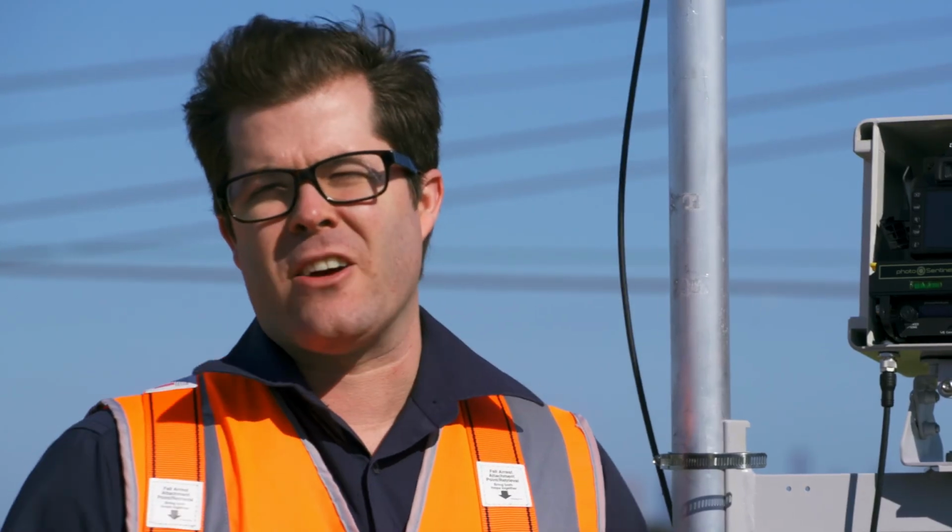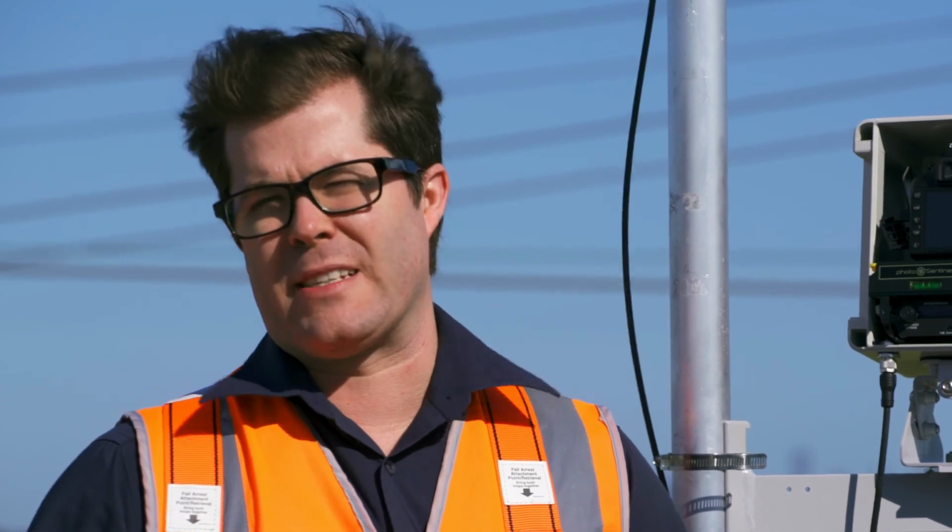I recommend staying on site for a few cycles of operation just to make sure everything's running smoothly. The last thing you want is to get all the way back to the office only to find out that it successfully connected once and uploaded that first photo, but then for some reason died after that. So hang around for a while, make sure that it's getting that cycle in.